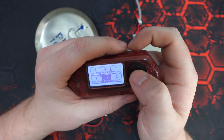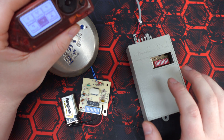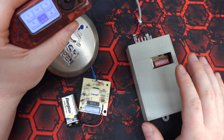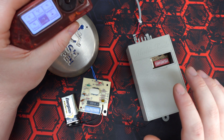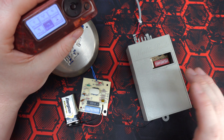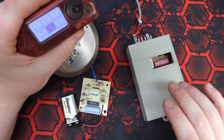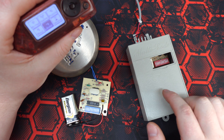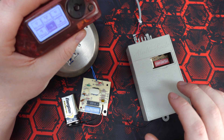Let's discuss brute forcing these. The reason this product can be brute forced is due to the use of the binary dip switches. There are 10 switches and each switch only has two possible positions — on or off — meaning there are only 1,024 possible codes. 1,024 seems like a fairly large number, but using the Flipper to transmit every single one of those codes five times in a row will only take about three minutes and 50 seconds or so.